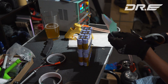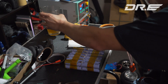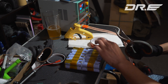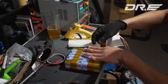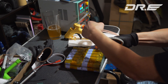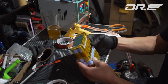When you're done, you should have all of the positive terminals of all the pairs coming out, plus the negative of the first battery, all from one side of the battery for easy access. When I first built my battery, I had terminals coming out from both sides and wires going everywhere — this way is much cleaner. I'm going to put Kapton tape all over it because this battery pack fully charges to 50 volts with 90 amps of power, which is probably enough to kill a human being. Make sure you tape up everything with Kapton tape. I'll also use extra Kapton tape to hold the battery pack together vertically, in addition to the hot glue.